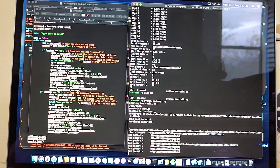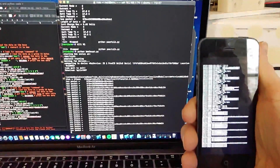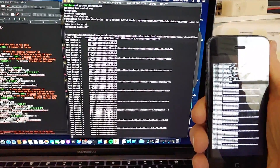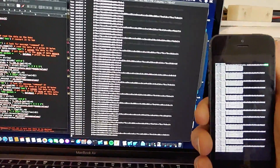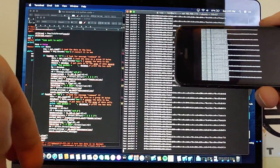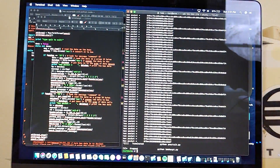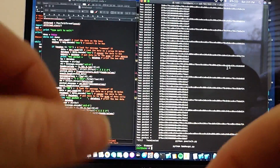What I really want to do is just send over the hex packet data, so I created a program that does just that. You can see it's literally just sending the hex packet, and then I'm going to decode the hex packet in Xcode. You can see the hex string data is actually coming over onto the iPhone, and it's pretty well correct in its timing. If I stop the program it pretty much instantly stops — so it's sending data at speed. We got that figured out without any delays or problems.